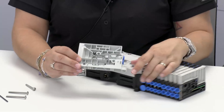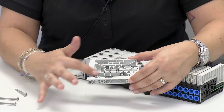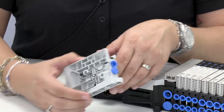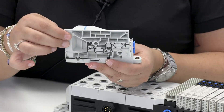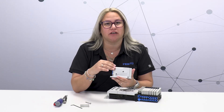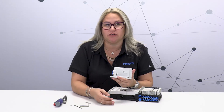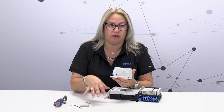After we've taken the end plate off, you can see that all the channels are here. On that end plate is where we will be controlling the pilot. One of the nice features about all Festo valve manifolds is that the pilot is actually controlled from the manifold sub base, not from the valve. That means that if you ever want to change from internal pilot to external pilot, it's very easy to do in each manifold by just simply changing a few parts.